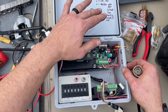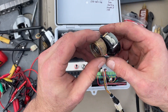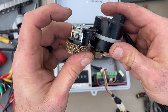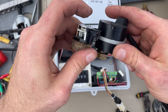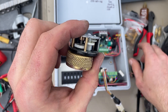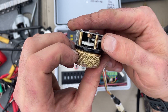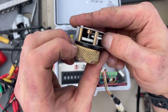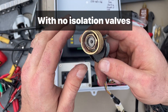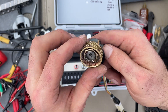Anyway, so inside of this there is a motor that sits up here — a little stepper. Sorry, it's windy out if you're getting a lot of wind noise — and that's geared way down like this. What this thing here, besides being a pretty sweet cutaway, allows me to do is, like, if I've got an indoor unit that's bleeding by — like the EEV failed — I can put this on there and manually close it down. But that's how these work.